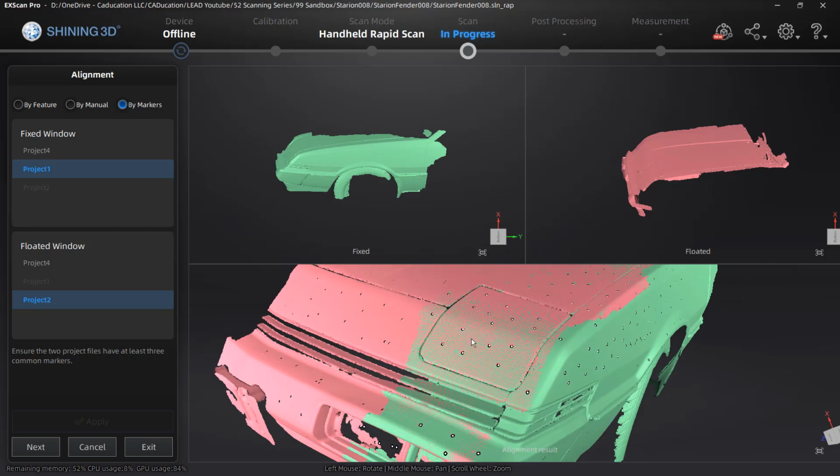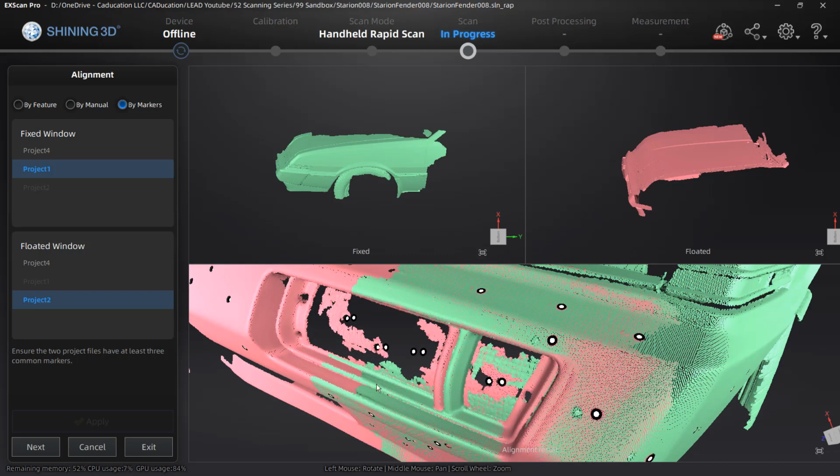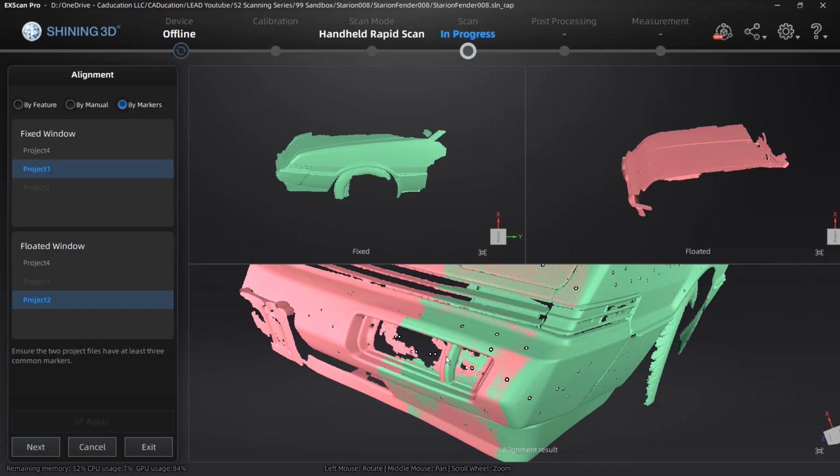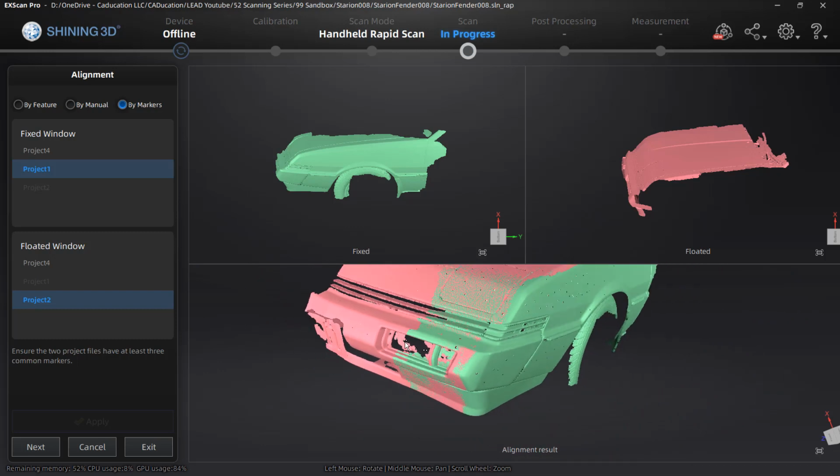The pop-up aligns pretty well, but this feature got shifted and lost. And that's pretty reasonable because whenever you have a consistent long feature like this, especially since it's a clear lens, I put tracking markers on there, but you can see that the markers actually were double counted again. That is going to be the distance that they were shifted one way or the other. Now, it probably happened after a pause in the scan and a rescan of that area. But again, I'm not too concerned.